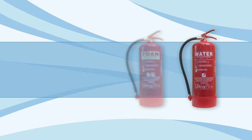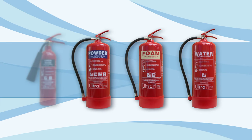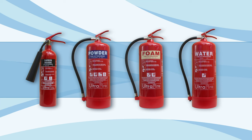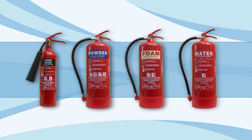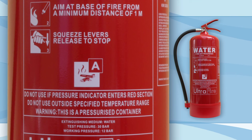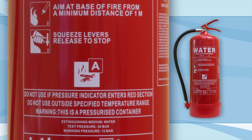As you can see, many fire extinguishers can be used on more than one type or class of fire. The important message here is simply not to use an extinguisher on a type or class of fire that is not indicated as acceptable on the extinguisher. For example, a water extinguisher, which is only suitable for class A fires, that is fires involving ordinary combustibles, should never be used on fires that involve a live electrical source.